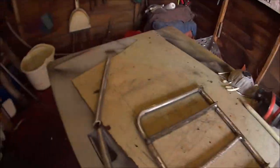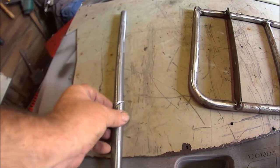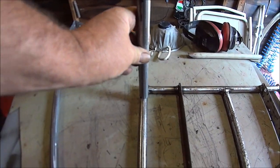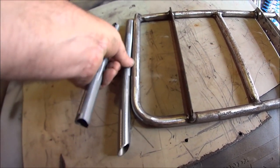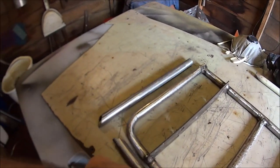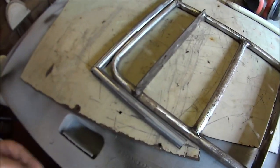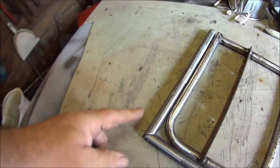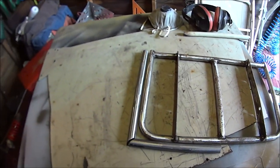So I've cut one piece off, cleaned it up, and tried to cut it down at a 45-degree angle. That'll go there and there, another one there, and this one across the top. So if I put that there and against there like that, hopefully that should be square. If I try and weld that bit, it should be good to go. All I've got to do is cut it off to the right length and then do an up-and-down piece, and hopefully that side will be done.